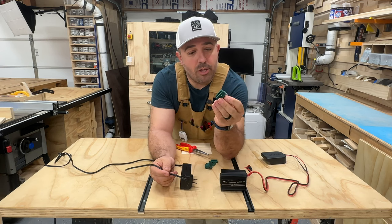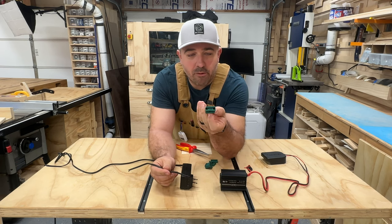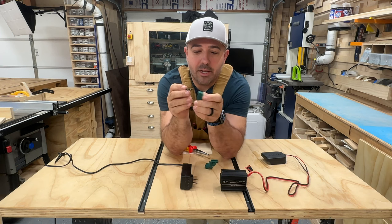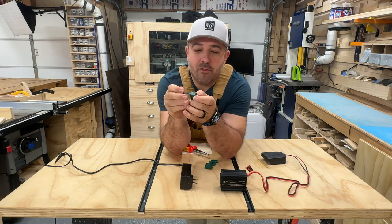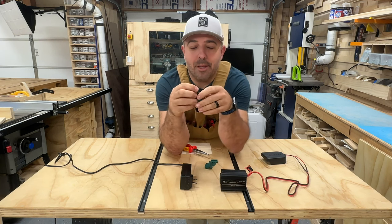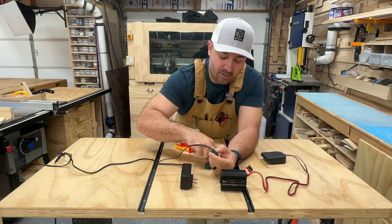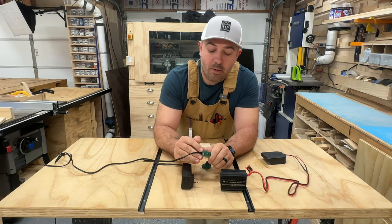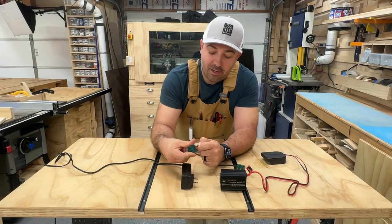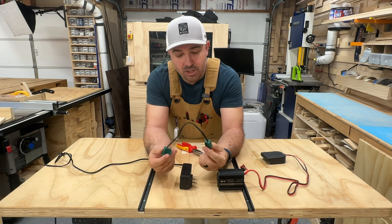What I'm going to use is called a Gilbert plug. It's probably the easiest wiring thing you'll ever see. It has two little spikes inside. What I do is I split the two wires so they're not touching — I don't want them to arc inside this plug. I push them into a little pocket that has a divider keeping the two ends separate. Then when I lay the wire down on top of the plug, those two spikes pierce the wire sheath. Once I slide a cap on, I have a male plug. I do the exact same thing again at the other side — jam the wire in, lay it down, put the cap on. Boom, you have the smallest extension cable you've ever seen.